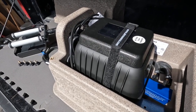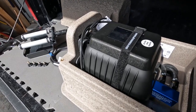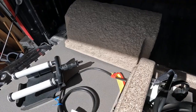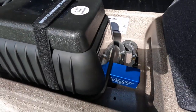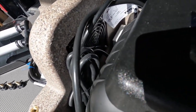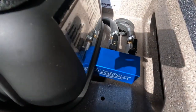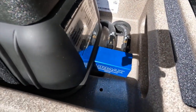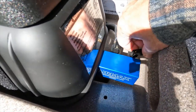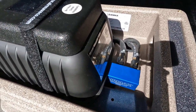Like all the AirMax packages, it's really one of the only commercial dedicated shallow pond systems that is fully featured. It has an excellent poly cabinet with a cover, and it comes with an intake filter as well as a cooling fan for exhausting any heat buildup in the compressor. You also have a two-valve manifold — with all commercial systems you'll see a dedicated valve for each diffuser in the system.